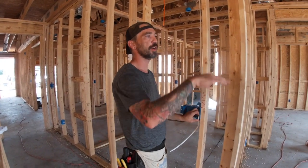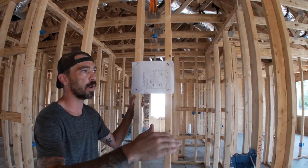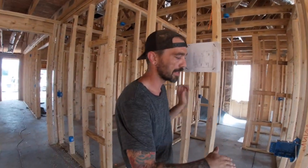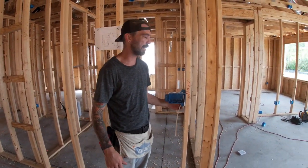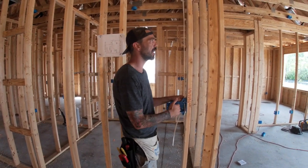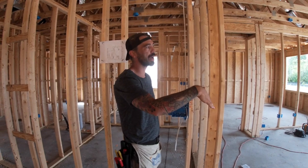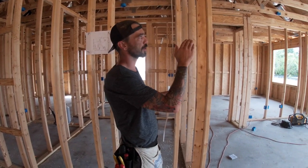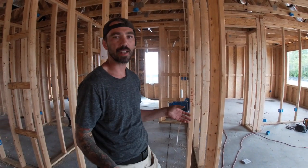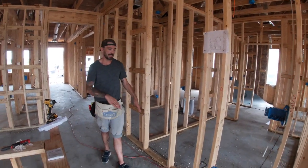I'm going to make my first jumper over to the back door. There's a dining light — I'm sure a lot of people want to put the dining light on with the kitchen light circuit, but it's only one light and I don't want to put two different powers in this box and start worrying about neutrals getting crossed up. That just makes things harder than they need to be. So I'm going to put the dining light on with the family room and the back porch. The back porch usually goes on with the family room, and I'm adding the dining room light just to keep this box simple.